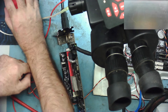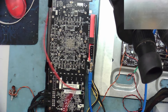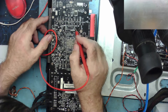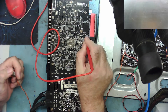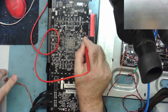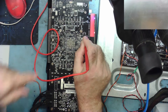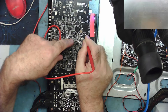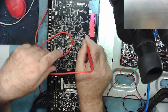Let's try another one — I've got a board here which doesn't boot. This graphics card is an R9 390X; it powers up but doesn't give a picture. The computer will bleep because it's got onboard video. If you switch the onboard video off, it gives one long and three short bleeps to say the graphics card isn't there. So we get onto pin 1 and power this up to see if we can hear it accessing the BIOS. There's a bleep but there are no clicks on the speaker — so we know for sure this one is not accessing the BIOS. It never gets as far as reading the BIOS, and that's useful information for when we come to actually repair this card.